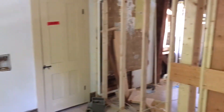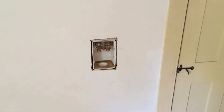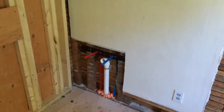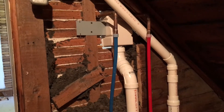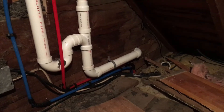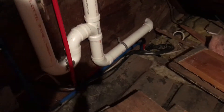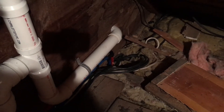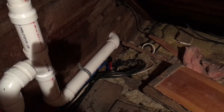Looking into the laundry room, the laundry hookup is now there, and there's some PEX plumbing behind feeding that now that runs down. And obviously we have the PEX plumbing here for the sink supply. I'm in the attic over the kitchen now. You can see there's the drain line for the washer as well as the water supply lines. The drain line feeds in and goes down through the pantry wall downstairs, but those PEX lines go right down through the wall. I believe they were snaked down through the existing wall downstairs even though it's not demolished, because I don't see them downstairs — they just run down to the basement.